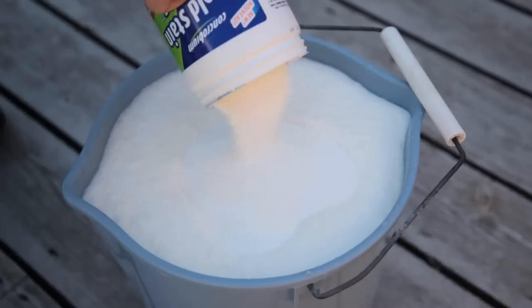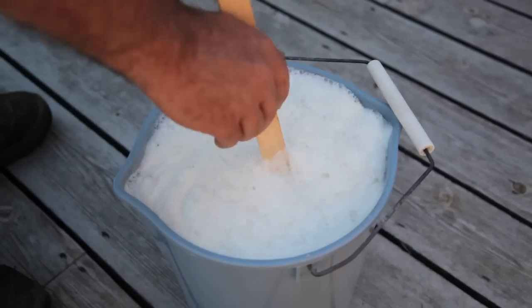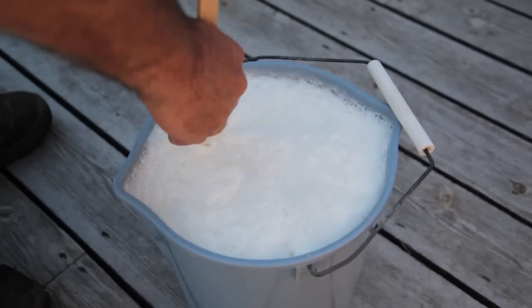It's an oxygen-based product that comes as a powder. Mix it with warm water, let it sit for 10 minutes, then apply the solution onto discolored surfaces up to 45 minutes after mixing. In my tests, Mold Stain Eraser removes mold stains in many situations without changing the color of surrounding materials. The active ingredient eventually reverts back to oxygen and water, so nothing harmful is left behind.